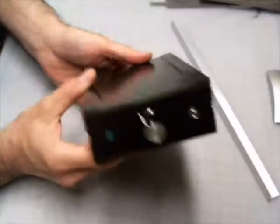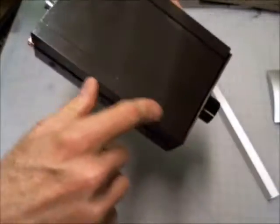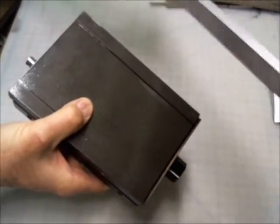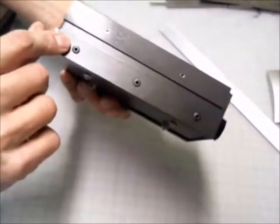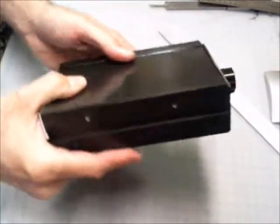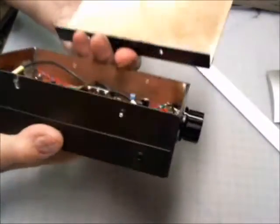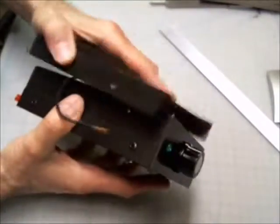Here are some lessons I learned. The first one I've already mentioned: I wouldn't rely on just glue to hold the PC board material panels together with the L-section aluminum — pop rivet those or screw them down. I'm not against glue, but it would be better for electrical continuity of the ground — a little bit easier to maintain with no glue in there at all, just putting the aluminum against the copper cladding of the board material.